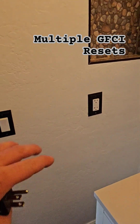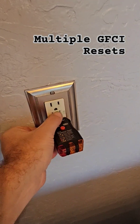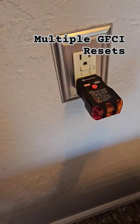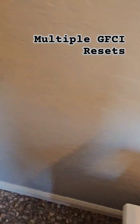These are usually wired in series, so it goes from this bathroom, which is in the middle of the house, to this GFI. You can see I just tripped it right there. It won't reset until you reset the other one. So let's go back and reset the other one.